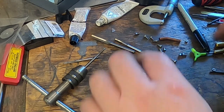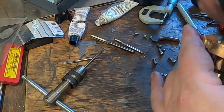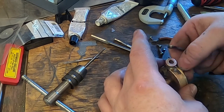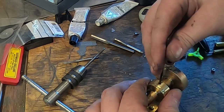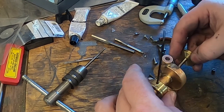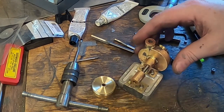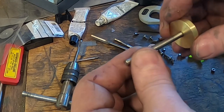So if we take that apart, this isn't coming off here ever again. Now it's lined up like that, and the bolts are tight. That's where it's staying. Put a coat of paint over the top of a lot of it, and as far as I can see, that's where it's going to be for the rest of its life. M4 screw in there, nice and big, rather than small. This is 3/32, which is 2.5 millimeters, hardly big enough to do any good. So I've learnt from experience that a bigger grub screw or a bigger cap screw, set screw to hold things in place, is probably a good thing rather than a smaller one.